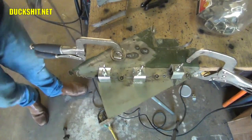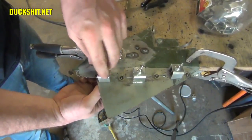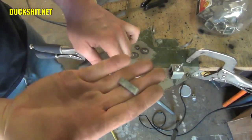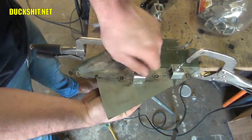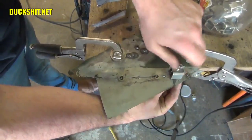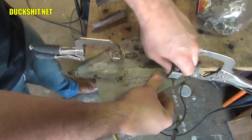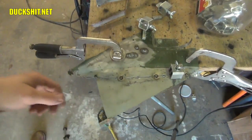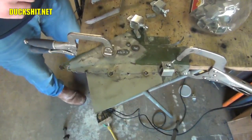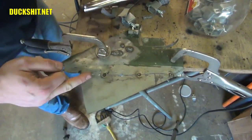We are very roughly tacked in. I would normally add a little more weld to it than that, but I think that ought to be enough to hold it. We can start taking these clamps out — first the bar from the backside, then the clamp itself. Repeat with the next one: loosen, first the bar, then the clamp. And our last one — this one's actually in there a little tight. That happens sometimes; sometimes these panels will shrink a little bit. There we go.